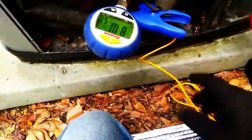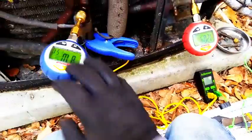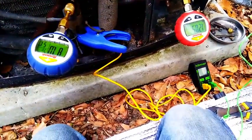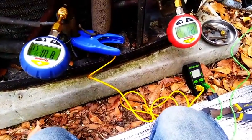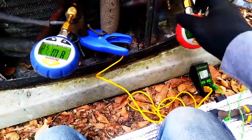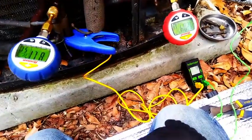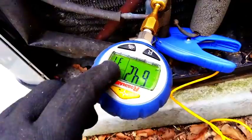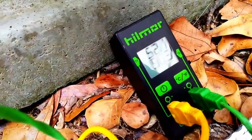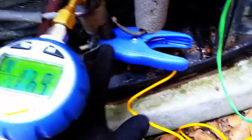Room is at 20.5 — a little bit of separation because we have a TXV. You'll notice when you have a TXV and it's a hard shutoff, you'll keep that difference in pressure between the suction and the liquid line. 50 degrees outside, we're running 64 PSI on the suction pressure with 37 degrees saturation. That puts us at about 15 degrees superheat with that 52 degree suction line.